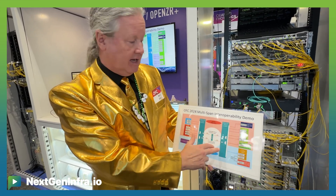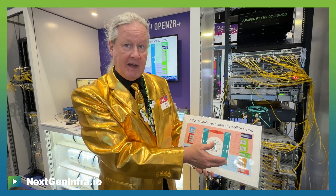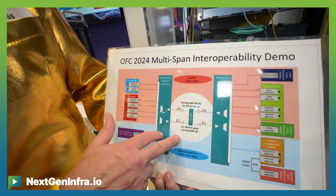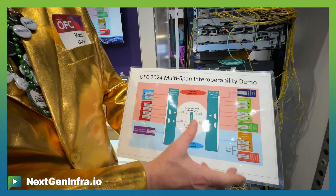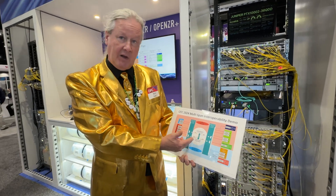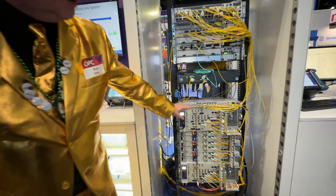I've got a thousand kilometers in one direction using the new Corning SMF-28 ultra low loss fiber, and in the other direction we've got the same eight spans but only a hundred kilometers per span — that's standard SMF-28. We have both terminal ROADMs as well as a set of equalizer ROADMs to balance the channels in the middle.